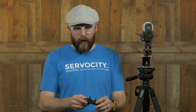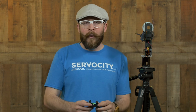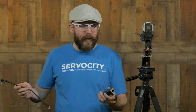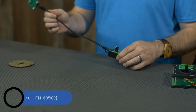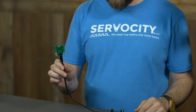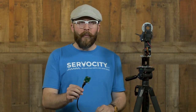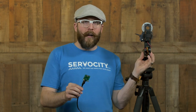Since these are continuous rotation servos, they could just keep going and going if you want a setup like that. The other nice thing about this particular controller is you can span a long distance without going wireless. So if you're in a location where there's a lot of RC interference, like near an airport, you can actually use a Cat6 cable that connects into the end. With one of our booster boards on the other side, the booster board has pins where you plug in the servo, and you can either send power to the servos through the Cat6 cable, or if you're going over a great distance, you may prefer to have a battery on the pan and tilt head and connect that battery right into the booster board.